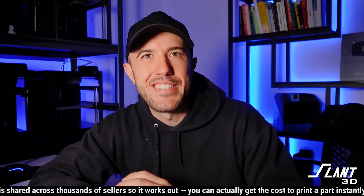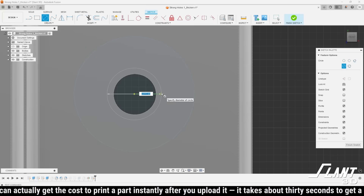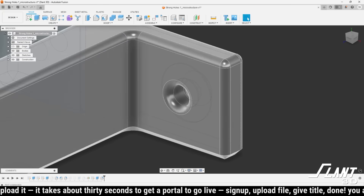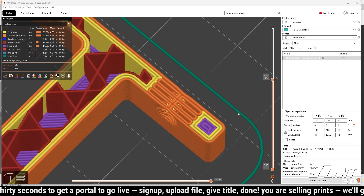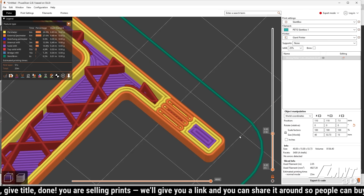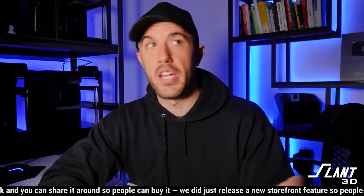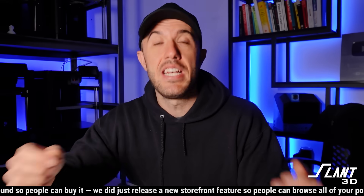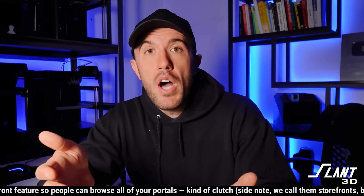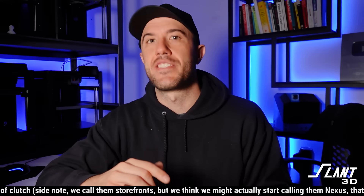The way you do that — you cut up the part. This is going to sound counterintuitive, but what you can do is around the hole, basically just put a disc and cut it so that it's like a 0.1 to 0.2 millimeter thick cut. What it does is induce any slicer to create walls around that area, which are not visible from the outside. So if you have a one millimeter thick wall and a two millimeter thick part and you create a small cut in the middle of it, you just created a solid part. You can put these discs around holes and create a fully solid area around that part. You can repeat that pattern over and over again and create these solid rings around your hole.